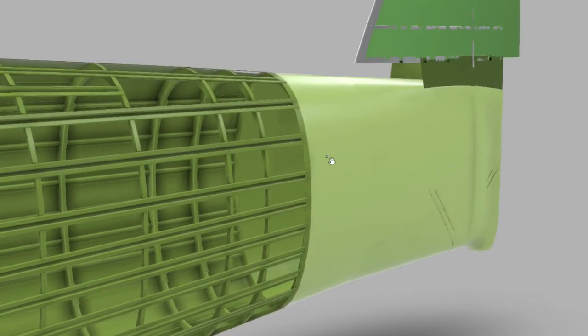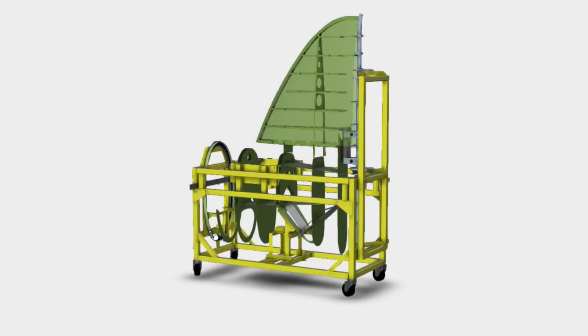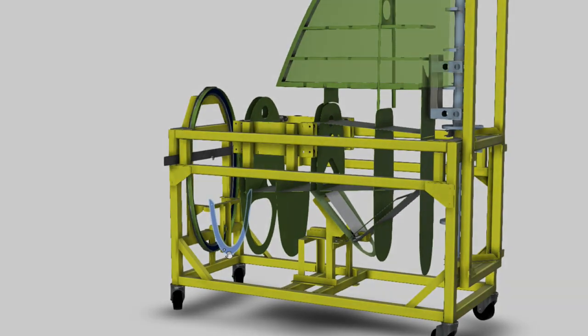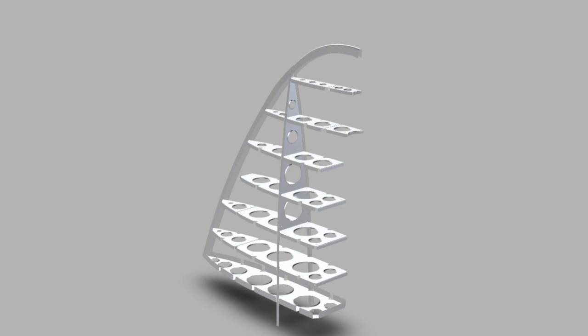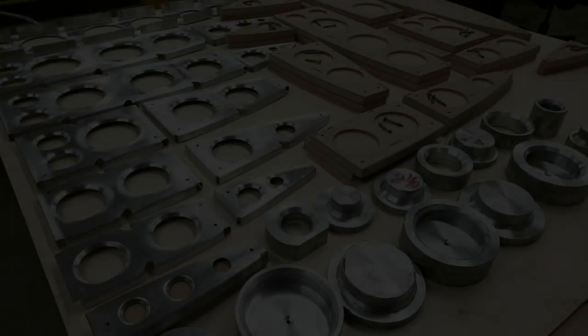The transport joint consists of, in either design configuration, frame K and frame L — frame K being the rearmost forward monocoque frame and frame L being the forwardmost rear monocoque frame. The rear monocoque goes from frame L to the stern post and fin post of an integral fin monocoque section unit, and it houses the retractable tailwheel. This section had some reinforcing with the addition of a modification quarter frame identified as frame M fitted to the lower section, which ultimately became a full frame at that location. The rear monocoque has a series of frames and stringers but also includes diaphragms and diagonal bulkheads for rigidity around the tailwheel pivot point.